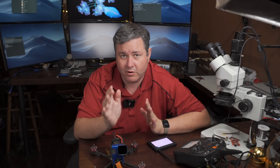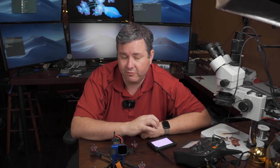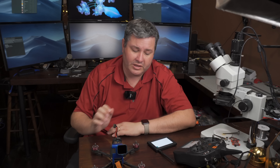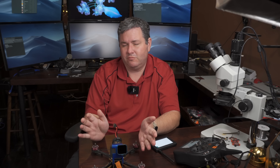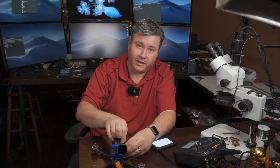Put the quad on its nose and push the roll stick to the right, and the wizard is complete. You are now done — this quad has been set up. Now we're going to power cycle the quad. It's all set up and it's saved our config. Unplug it, wait about 10 seconds to make sure everything gets cleared, and plug it back in.